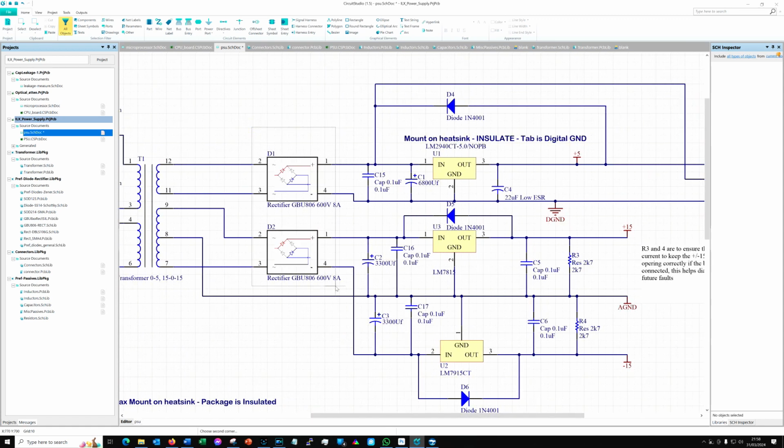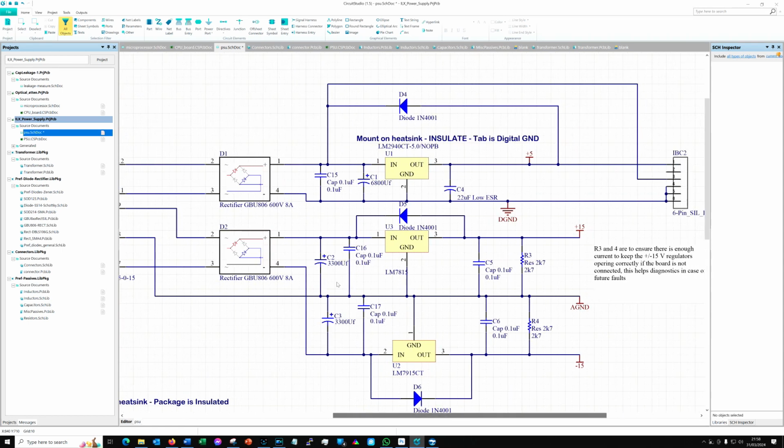So same type of diode that I popped into the other part of the circuit, because I've got several, why not? And then we're coming along, and in the 5 volt line, which is this top one, we've got one of those 6,800 microfarad capacitors again, which again just feels over the top for a 5 volt line that's only drawing 300 milliamps maximum. So anyway, there you go. And we've got a 0.1 microfarad just on the input to it.